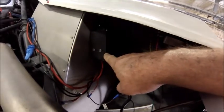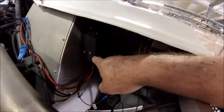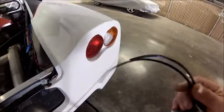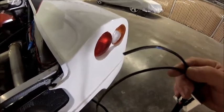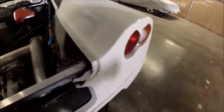All of this control comes into a special electronic module, which is hard to see, that I've designed into the back of the unit. This gives me basically as many remote control channels as I want, and I can use any types of linear actuators, lights, camera control, or whatever. The additional two wires that you see are actually for video feeds — we'll be putting in a rear view video camera, and the second one will be a GoPro camera that will be fed into a control station in the console.